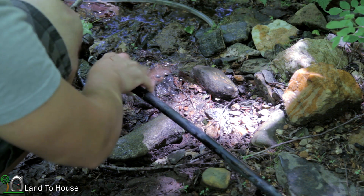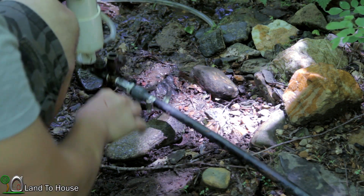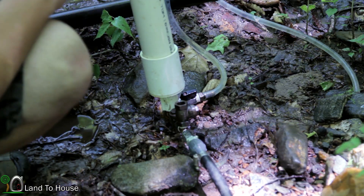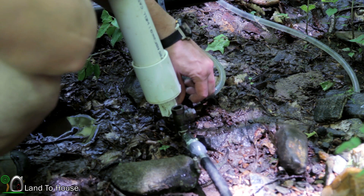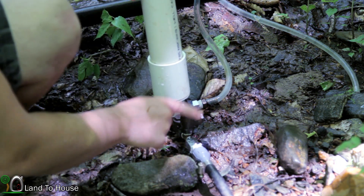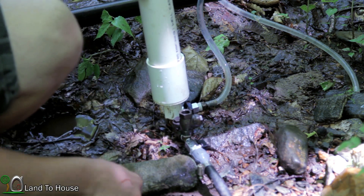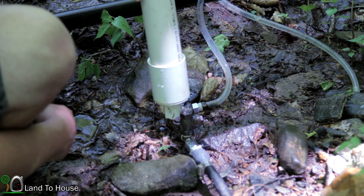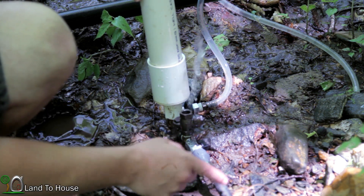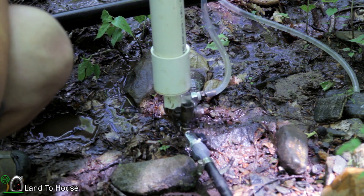I'm just going to tighten this up enough to get it on here. I'm going to close the delivery pipe because there's not enough back pressure to keep this going, but we can see if this valve is going to close with this volume of water. This increased volume seems to be doing the job now — really quick cycling.